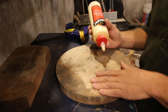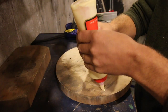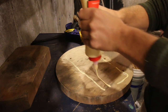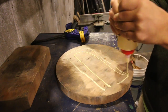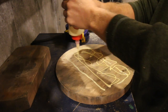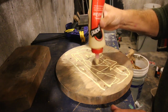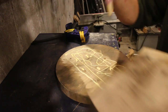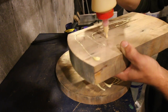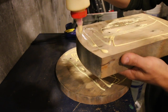These two pieces being hardwood — they are made out of maple — we want to clamp it all together after we have it all glued. I'm just going to apply our glue. They say you don't need that much glue, but I've always been a person who would rather have too much and let it squeeze out, then clean it up after. When I built furniture, I used to get in trouble for using too much glue, but my glue joints never failed. I'd rather have a joint that's not going to fail.